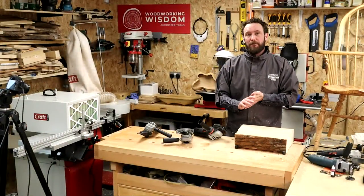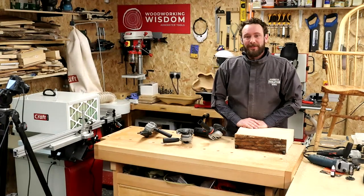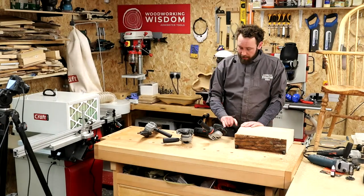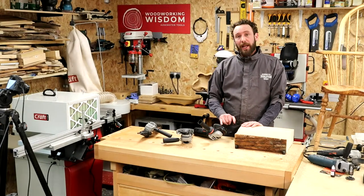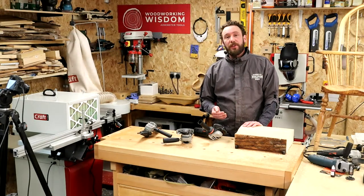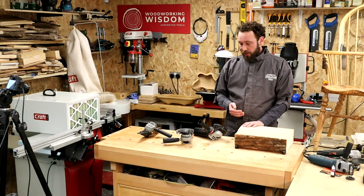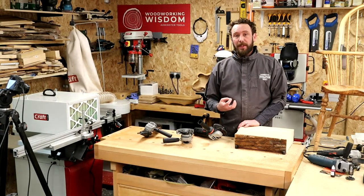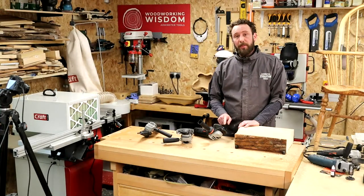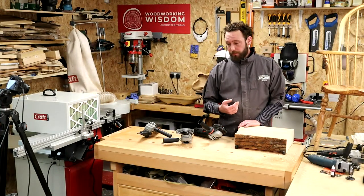Okay. So I've got a question here from Frederick. He's asked, how do you determine what speed to grind at, being a variable speed tool? So they'll have the max RPM on the blades. That's all printed on there. These run at 12,000 RPM. So the Arbortech with the turboplane on, you just run flat out.